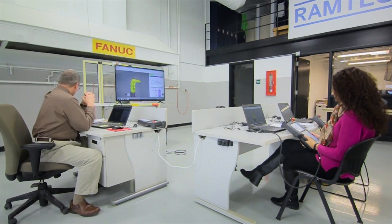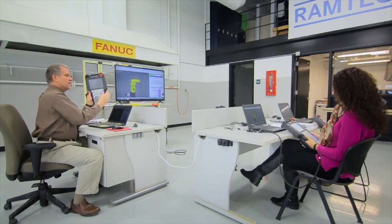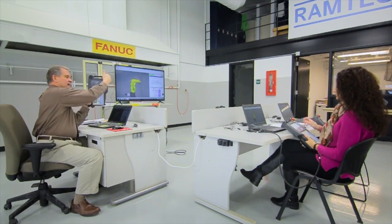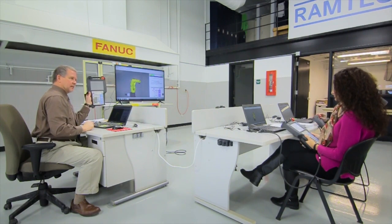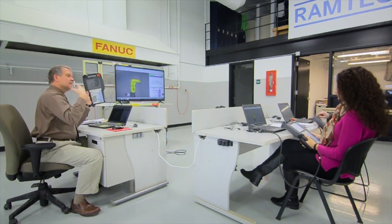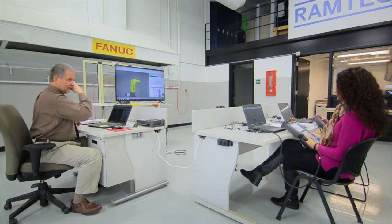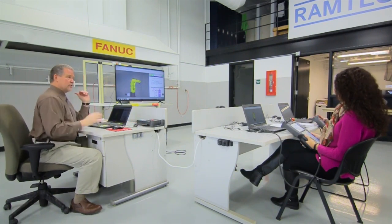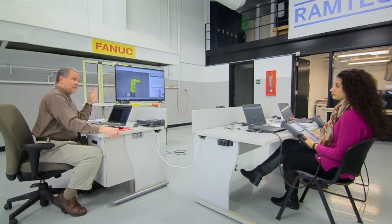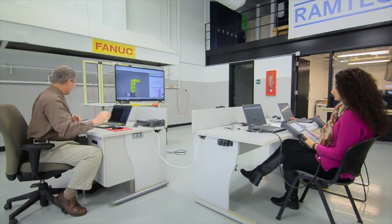On page 44, they show the emergency stop button — the e-stop button on these teach pendants. It's in the upper right hand; it's the most obvious button on there. Go ahead and press it — you'll notice it clicks and stays in place. Then the little arrows on it rotate it clockwise to take e-stop off, allowing you to continue using the teach pendant. So if you needed to stop the robot, you could grip the dead man, let go of the dead man, or slap e-stop. There are a number of different safety features built in.